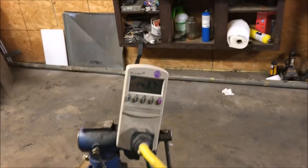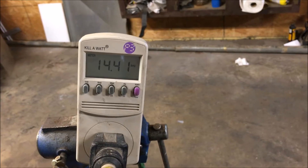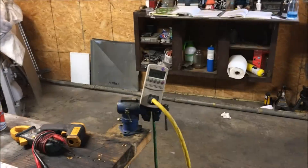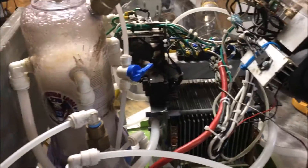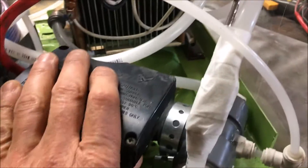But for its size, I bet you it cranks out twice as much gas as any other high-efficiency unit. You're probably on the verge of about 3.5 liters per minute right now. I don't want to test liters per minute on this yet because it's just too cold in the garage — it's about 60 to 65 degrees — and you kind of want to do that at room temperature because it does affect the output a little bit. I am getting no significant foam up.